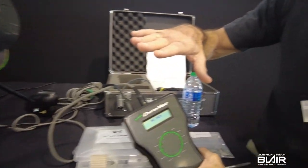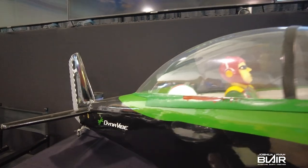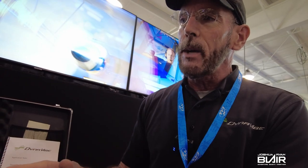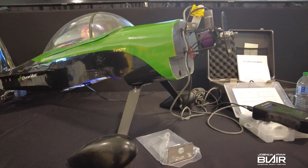What we would do is run the airplane on the ground at cruise RPM and hold it there for about seven to ten seconds to get a reading. That reading is going to tell us the prop RPM and how bad the vibration is. This accelerometer measures velocity.